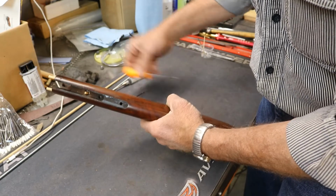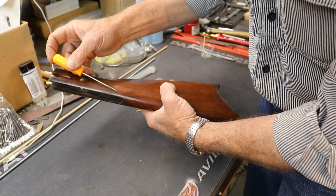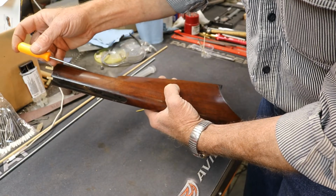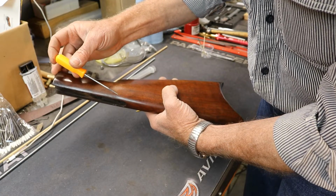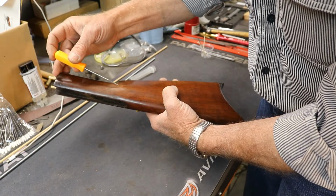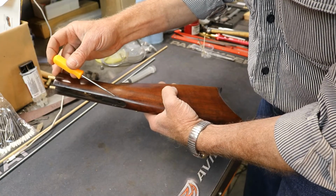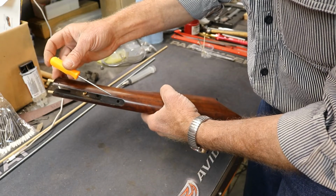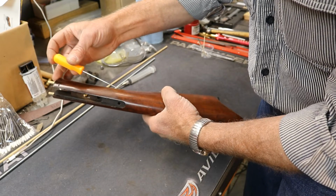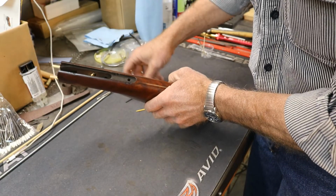But what happened is we drilled past this crack a little ways, and we actually got into the bottom of this one. So when we were augering that in with our all thread, we actually filled this crack over here too from the bottom, from inside. I'd like to say that was planned, but actually it was just a happy coincidence. And so we fixed that crack as well from the inside out. And so now we've got everything fixed up the way we need to.